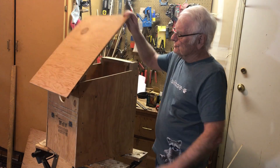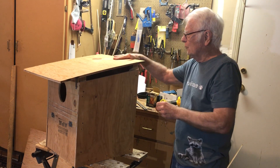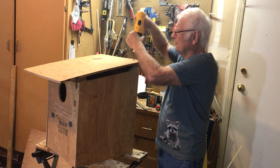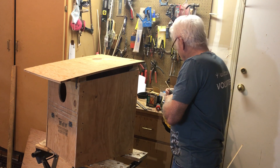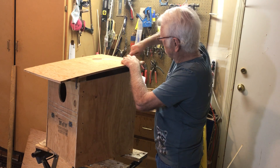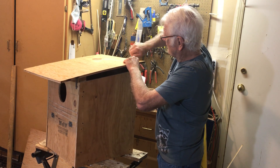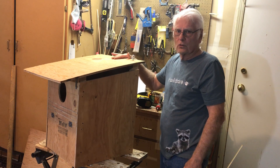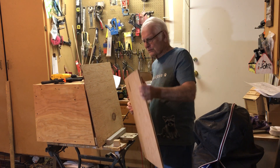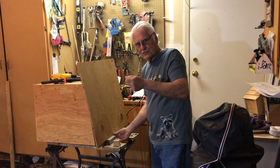We've attached the roof with the hinges and also attached the 10-degree bevel piece across here, so it all fits together very nicely. To hold this roof down, we're going to use the same screw eyes as before — measure to make sure it's going to be right into the center of one of the frames. The sunroof simply bolts onto the top using two-by-two-inch spacers to provide a little bit of airflow. Put it on, balance it on a piece of two-by-two — that provides a gap underneath so you can access those screw eyes to open and close it. Then center it and clamp it down.